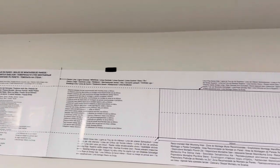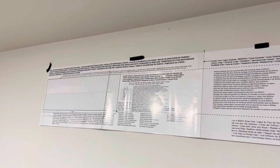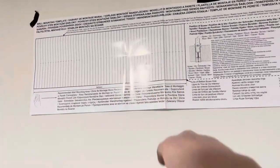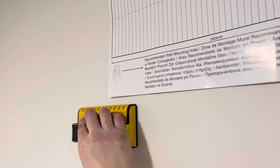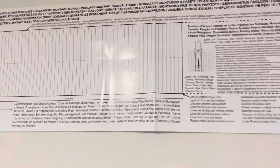Line it up on there — I used a level and measured off the ceiling. There is some adjustment, so even if you're off a minor bit you'll be able to adjust it to level it out. Get it as close as you can, then from there you can see where they recommend mounting. Take your stud finder and go through — look at that, I have a piece of lumber right there. Perfect — we got a stud right there, which I'll mark.